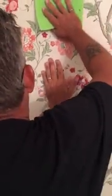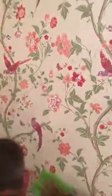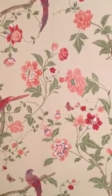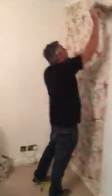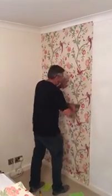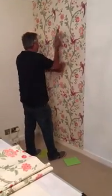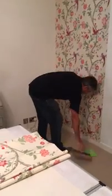Up the top it's going to stretch and it'll stretch to the bottom, but always get eye level spot on. Perfect. You don't have to plumb line it again, because the paper's level now, plumb now, so that is perfect. Running straight. So we just literally go all the way down, unfold that into there. And then from the middle up and out, get rid of the bubbles like that. You should never do it all the way down because you'll just pull the paper down. And then up and down. And that is it. Fingernail across there. Job done.